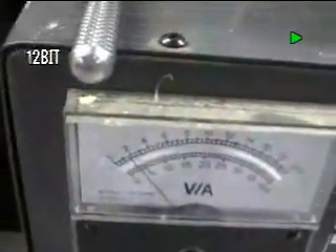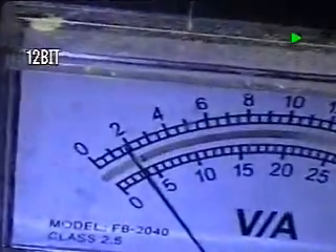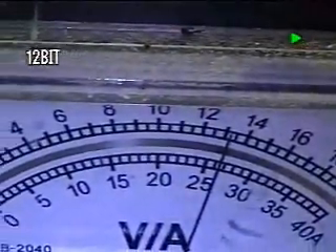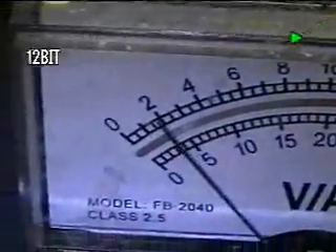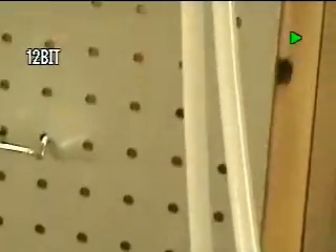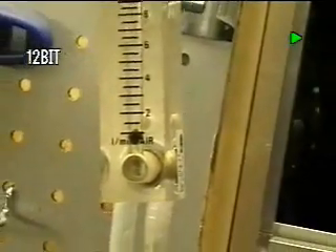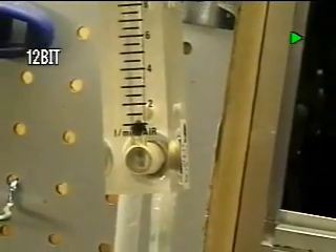This is not running on a battery. This is running strictly on a power generator, variable, and that's all it's doing. And still right now, as you can see, it's still running 3 amps. And the voltage is still 13 volts, top scale, 3 amps, bottom scale. And we're putting out gas, and we follow the line up. We can see our little flow indicator there is between roughly about one and a quarter liters per minute, is what it's doing right at the moment.